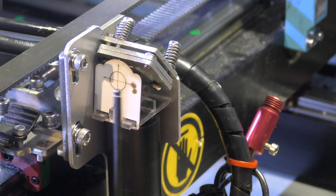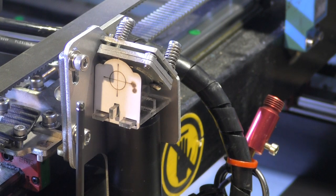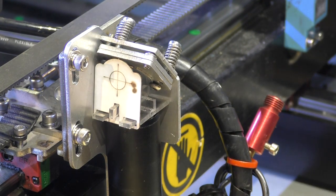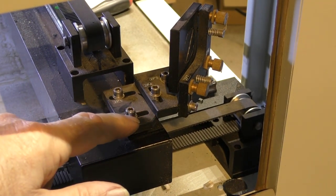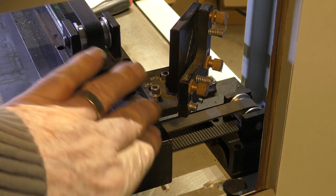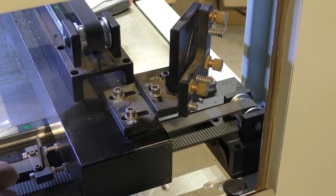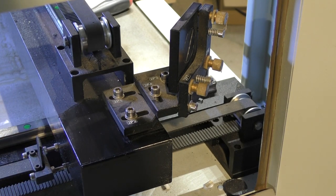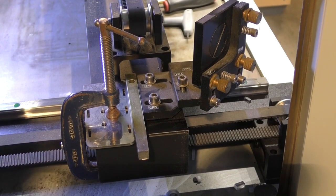Oh yeah, okay, so we've now got to get from here across to here. And the only way we can do that is to move the beam across with mirror number 2. It looks as though mirror number 2 has got lots of adjustment on it. So I should be able to get at least 8 millimetres that I want by pulling the mirror this way. There's no guidance or alignment on this thing at all. So I'm just going to be a little bit cunning. So there we go. There's a trick.